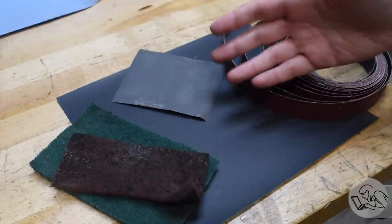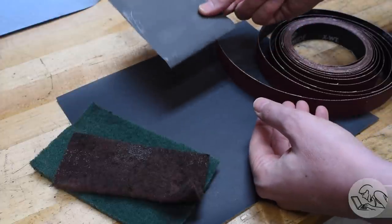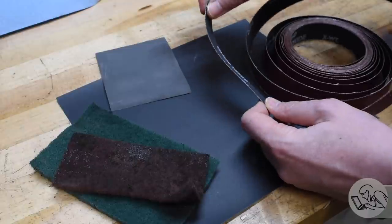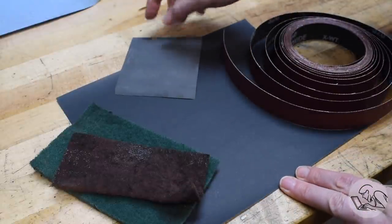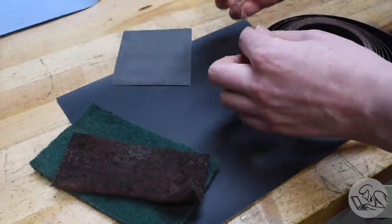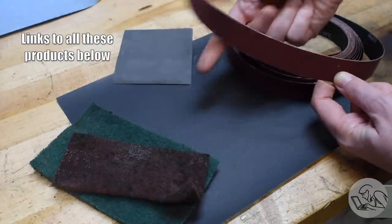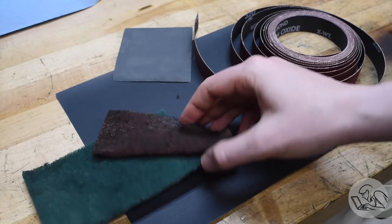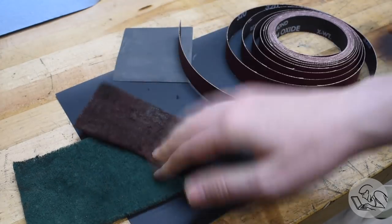But what about that word cloth? Woodworkers have sandpaper, and we have emery paper, but nobody talks about sanding cloth. Emery paper is basically sandpaper — it's got a paper coating on the back and it's intended to be used wet or dry. Emery cloth is the same stuff essentially but on a textile backing; it's thicker and more durable against cutting oils. In the hobby shop, emery paper is a lot more useful — it's easier to work with in small sizes and bends easier for working with really small radii. The cloth is very thick and heavy, but you can buy it in rolls which makes it easy to cut long strips for using on the lathe. Scotch-brite is just another family of abrasives — it comes in different colors equivalent to different grits.